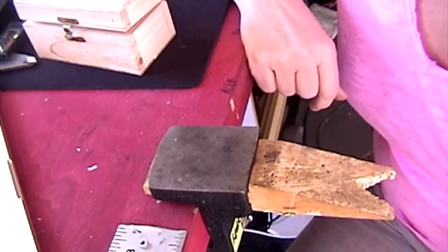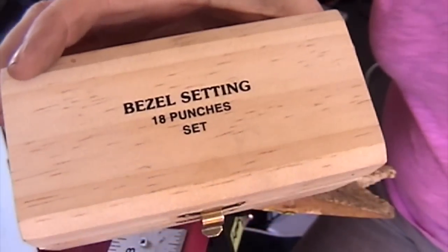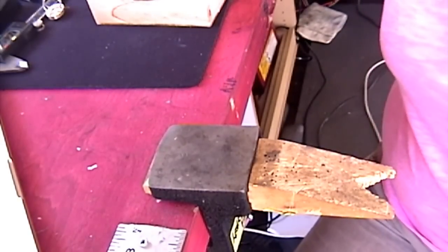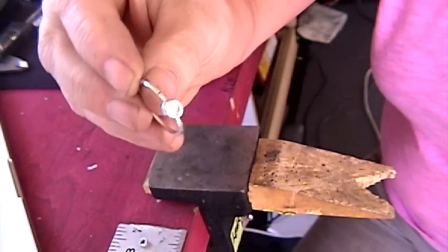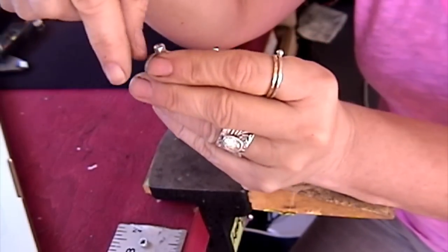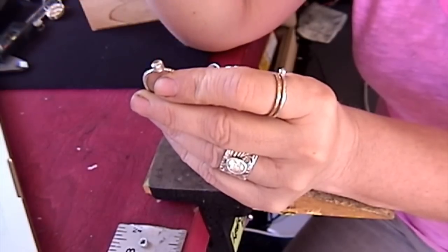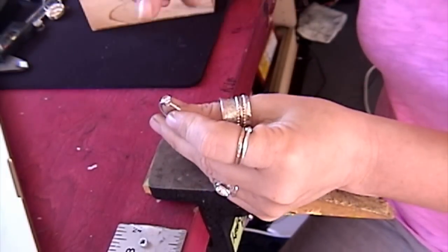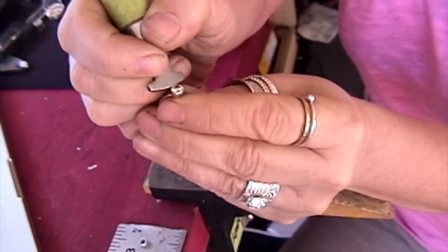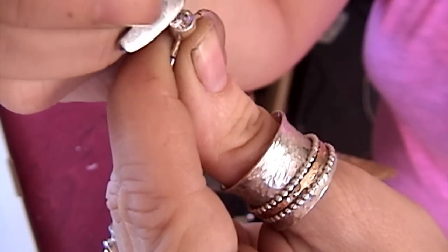So one tool I didn't show you yet for setting rings is called a bezel punch set. These are meant to work with the tube set. So if you're doing tube set rings, and we talked about this being kind of a tube setting, it has a tube soldered on, and it has a stone inside. What you would do is take the tube and solder it on your ring shank, then burr the center out with the drill burr that I showed you on your flex shaft, and then you would put the stone in. Then instead of using a bezel pusher, which I usually end up using, and rocking that edge over the stone as we talked about,